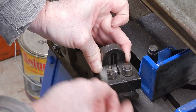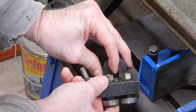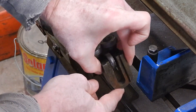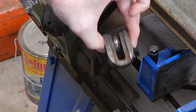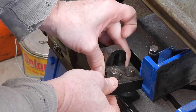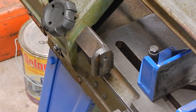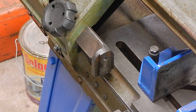Just file that away with a flat file or use your die grinder. You may also find that the way they've machined it isn't perfectly parallel — it might actually be on an angle rather than parallel, so square that up and grind it back. That will almost certainly solve your problem — it will give you that extra amount of twist that you require and the problem is solved. So there you go folks — if it works, post a comment and let me and others know. See you later, cheers.